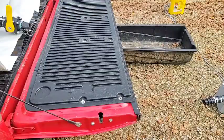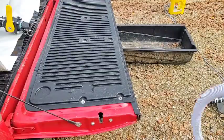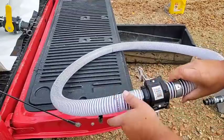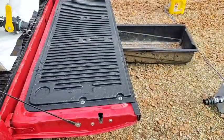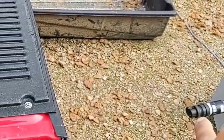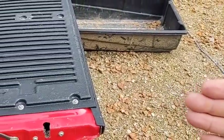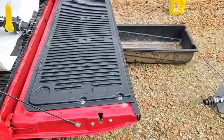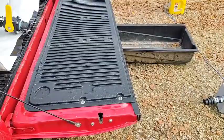The last upgrade I made to my water hauling system is to get a flexible hose with a female and a male attachment. In the past I used to have to pull in within a half-inch tolerance — sometimes less — so that my pipe over here would line up exactly with my outlet or ball valve. Now with this flexible hose, all I have to do is connect it and it flexes enough to connect the two together without much trouble.